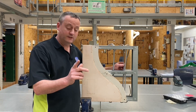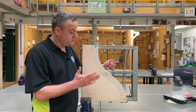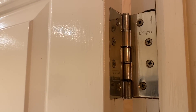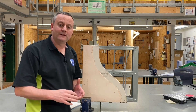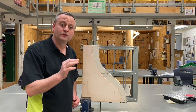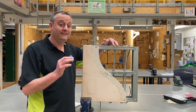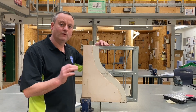Obviously there's a massive risk — we could end up nicking into our cable and the frame itself could become live. If the frame becomes live you may not notice it; you might be touching the insulated plasterboard and never find out. However, the frame could be attached to a door frame with a metal hinge, and that metal hinge could become live. You can imagine the consequences when you're trying to paint around that hinge — you might wipe off paint and only then discover the hinge is live, creating a massive risk of electric shock. So to overcome that, all circuits run within metal framed stud walls require either earthed metallic cable systems or steel armoured cable, or those circuits need additional protection by an RCD rated at 30 milliamps.